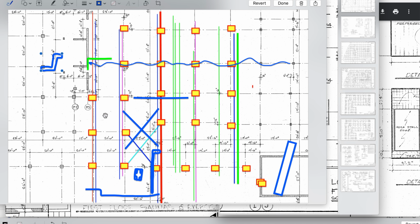The 11 foot 10 was supposed to stop here. So the building was always to have a 2 foot 6 slab elevation change. That's going to act as a nice composite beam, if you will, a larger beam, keeping these stable between each one of these columns at the parking garage. I'm sorry, keeping them more stable because they're larger. Now, depending on how they wear and tear and over time, it could be a negative, but that's more than likely not a negative if you keep the maintenance up.